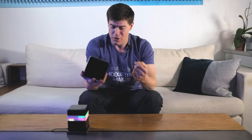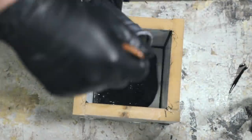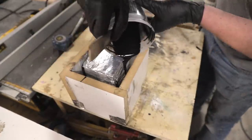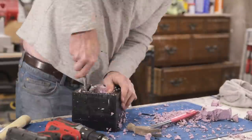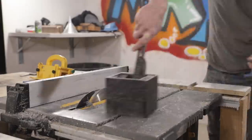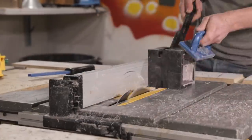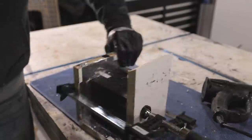The first thing I did differently was make a foam insert and pour the epoxy over that so the cube would come out of the form hollow — this is just Foamular foam you can get at any big box store. Now for the issue of replaceable LEDs: the easiest way is to make the white epoxy diffuser extend all the way through to the inner wall so you can just put the LED strip inside the cavity and replace it if you want. What I decided to do was, after popping it out of the form, cut opposing sides on the table saw and pour the epoxy diffuser on either side — let that cure, then flip it over and cut and pour the other two sides.